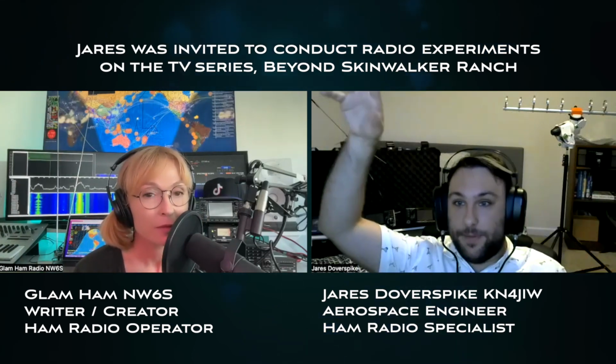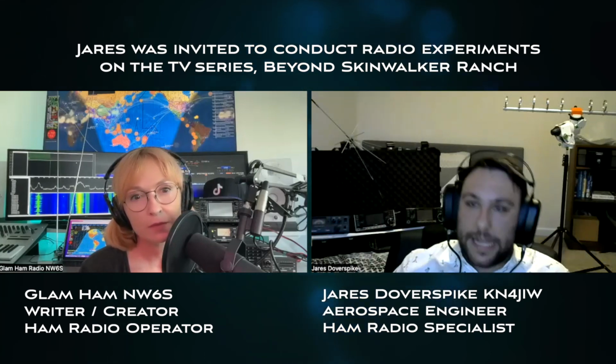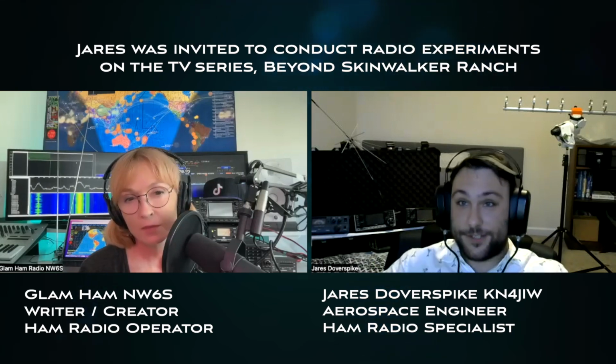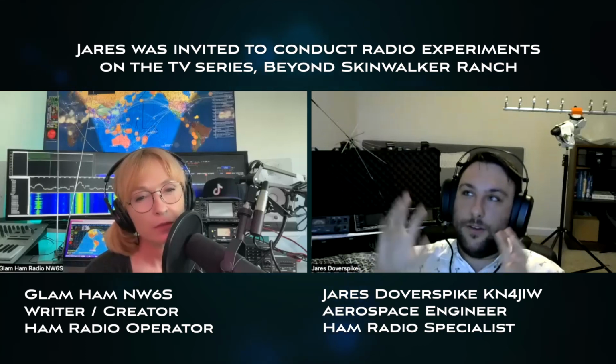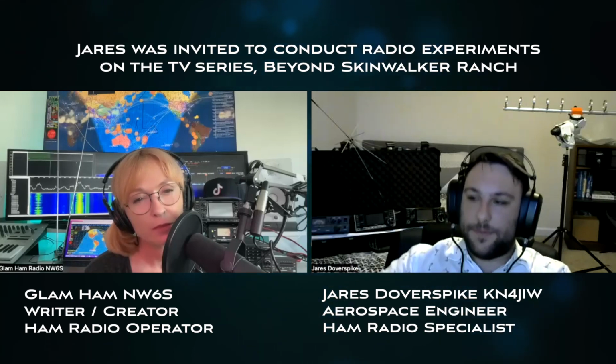So my one concern with that is spurious emissions require, by definition, a larger signal to be the main base signal for it to be bounced off of. So we would be seeing something huge in comparison to the 1.6, more than likely. Based on what we're talking about, spurious is mostly going to be something close. I can't necessarily think of anything, and of course I'm not doing any research right now, this is just going off my memory, and as we saw earlier, I'm not always the best at remembering all of these different things. But I can't directly think of anything that would provide what you're talking about in terms of the spurious emissions, rather than it being some weak signal that we're seeing from something else directly.